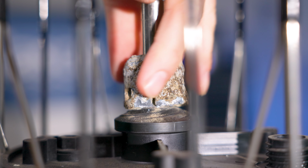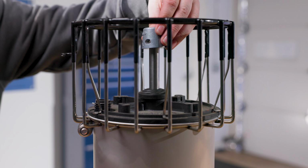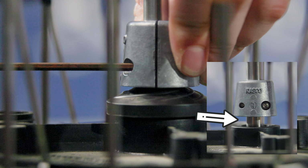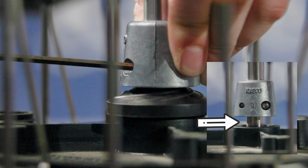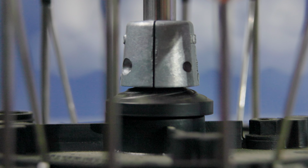Once the old anode is removed, grab your replacement and start installing it on the motor shaft and resting it on top of the debris flinger. If the unit does not have a debris flinger, then place the anode a half-inch above the seal guard. Once the anode is in place, tighten the screws using your 9/64-inch long handle Allen wrench. Once your replacement anode is secured on the shaft, reattach the float. Your unit is now ready to be placed back in your water source.